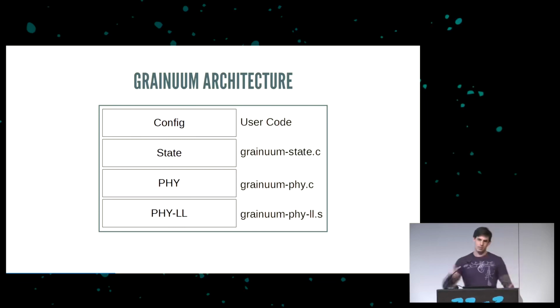You could relax the separate D plus D minus pins and port this to something that is slower than an M0 plus at 48 megahertz, and it would work just fine. So what I'm going to do now is start actually slightly below this, and we're just going to work our way up, going over the basics of USB.